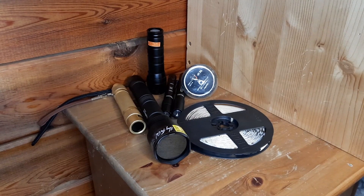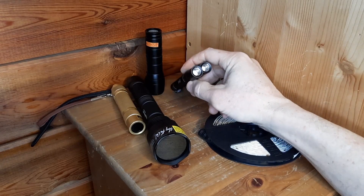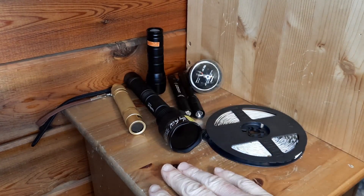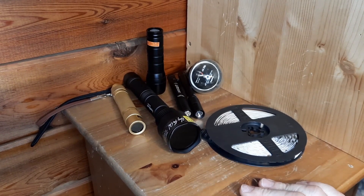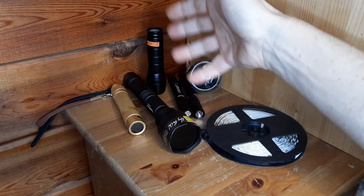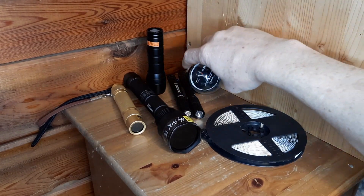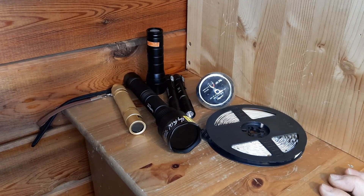In conclusion, the cheaper UV lights are trying to achieve the wavelength with just an LED bulb, whereas the high-end flashlights are using a filter that blocks all other light sources except 365nm. So these are a higher quality flashlight with a specific lens tailored to this job. The cheaper ones would probably be okay for going to the beach or kicking around the bush. The cheapest ones unfortunately are pretty much only good for a dance party.